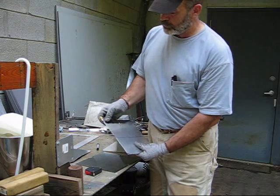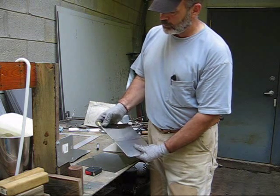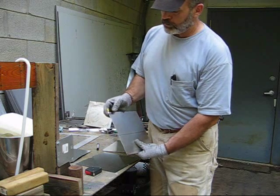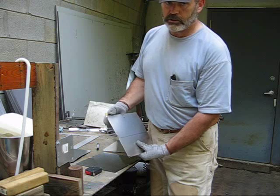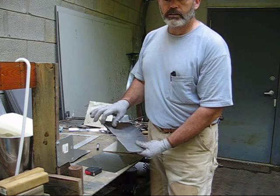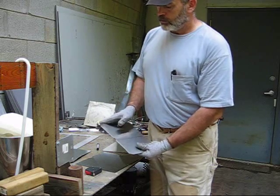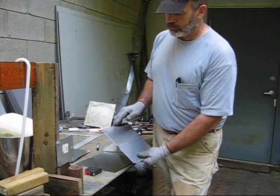That's pretty close right there, and I might have to cut that back a little farther. Make sure your terminal can fit on there without touching the other plate if you're going to use thin gaskets. If you're using sixteenth inch or eighth inch gaskets, don't even worry about cutting the corners off. All you have to do is cut your positive and negative plate and you're good.